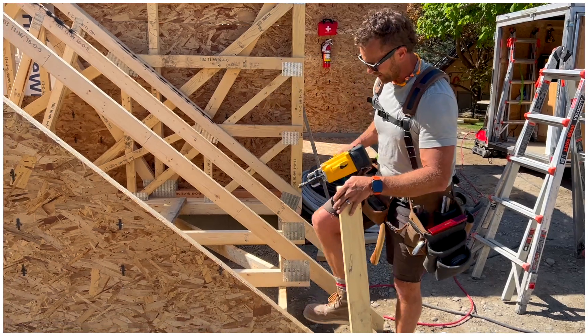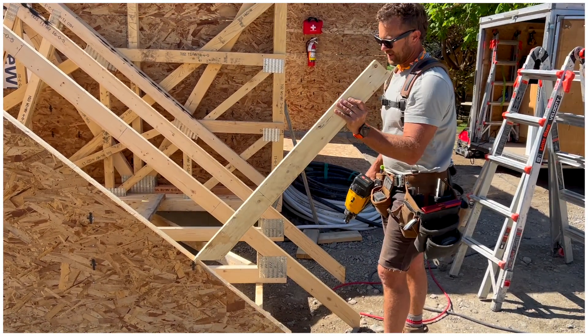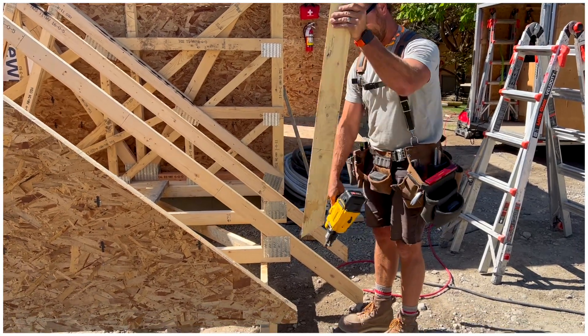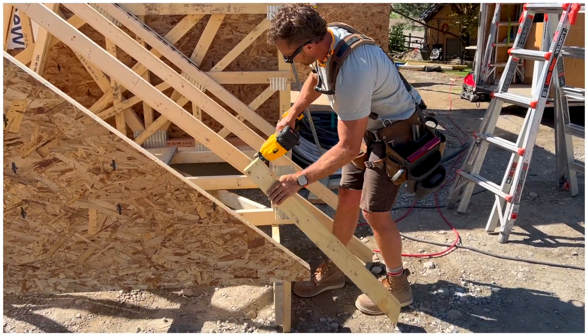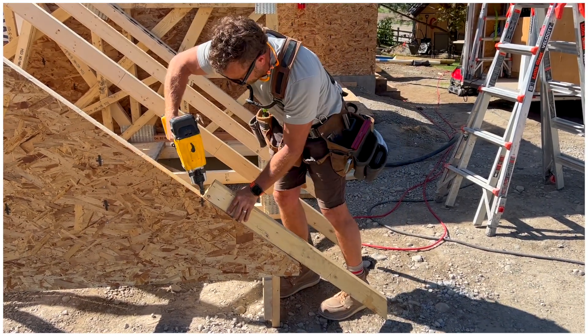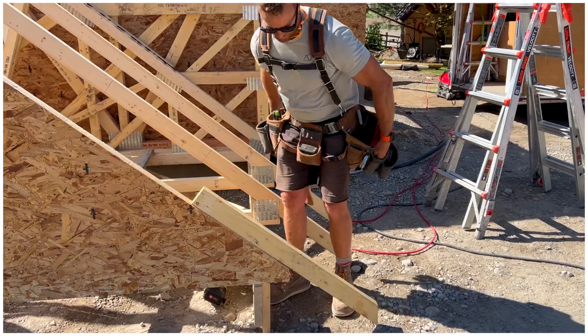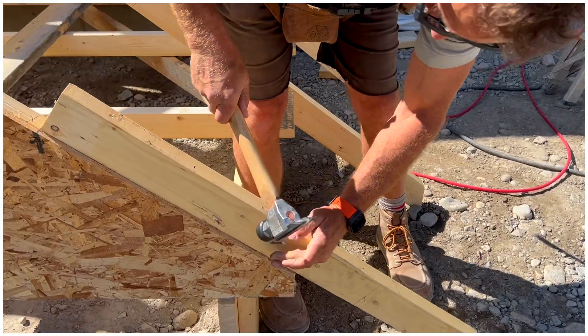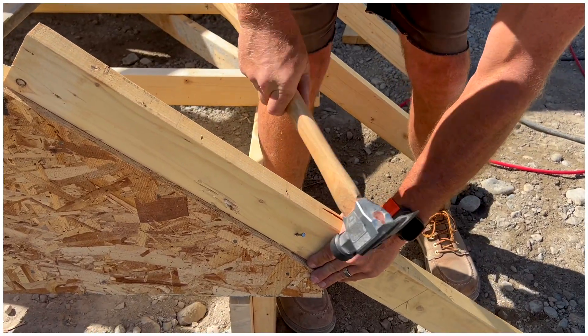Putting this side up — a few things I do as well. Make sure my outlook is at least 20 inches up from the end so I get lots of cantilever on this first board. That is measured off of my previous truss to match that. A couple of 2-inch hand spikes toenailed in down here to get these locked in place.